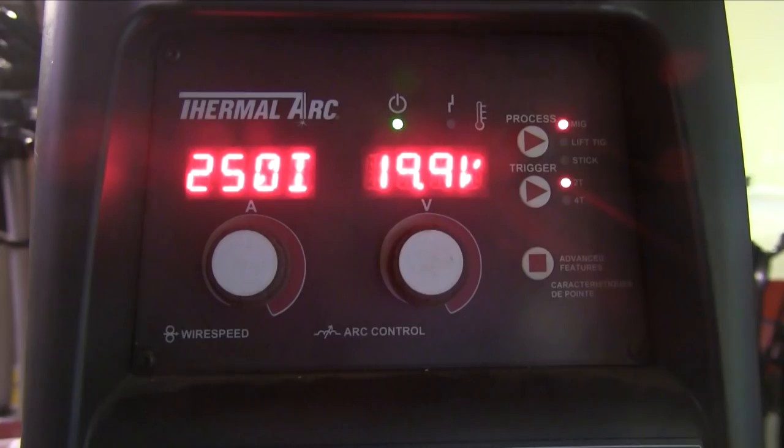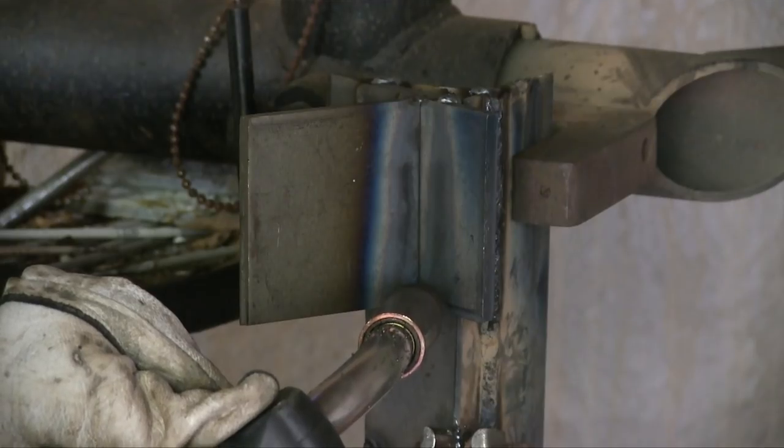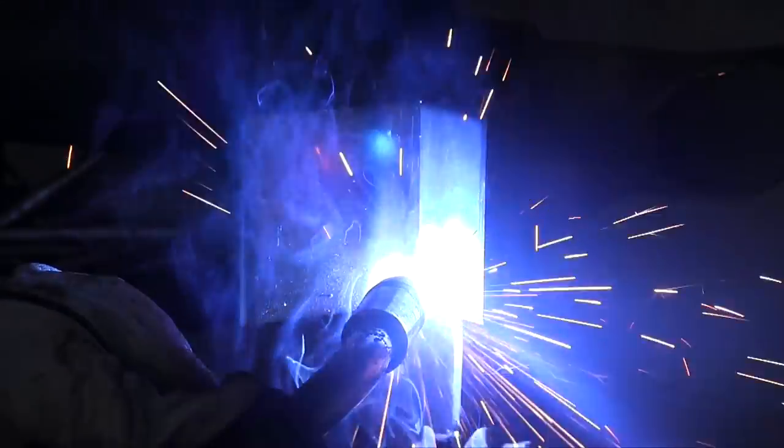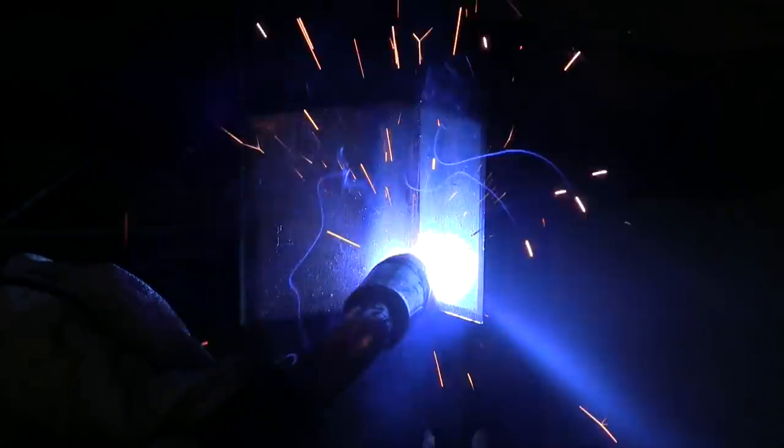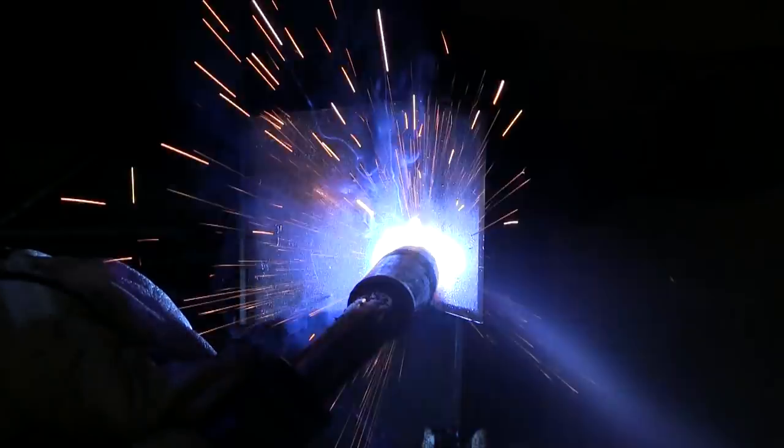Let's talk about the gas shielding issue. Before I left for vacation I was running some uphill joints using MIG — almost 20 volts and 250 inches a minute using 0.035 wire — and I got things dialed in fairly close: pretty smooth arc, no complaints, looking okay. Any problems were just my rustiness from not doing this all the time.